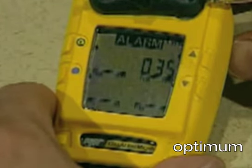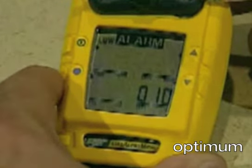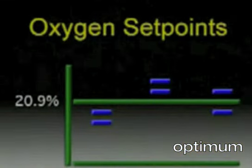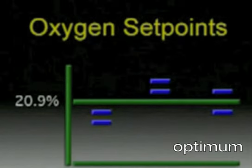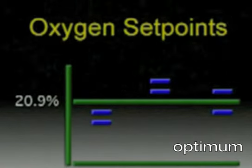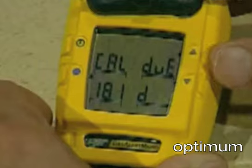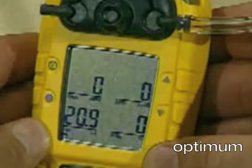Next, save or reset carbon monoxide values. Change or reset the displayed low and high alarm set points for combustibles or methane. Gas Alert Micro allows you to set both the low and high oxygen alarm set points below or above 20.9%, or one below and one above 20.9%. The detector will beep four times and then advise the calibration due date in days. Press the up and down arrows to change the days and press the OK button to confirm the new value. Gas Alert Micro will now beep five times and return to normal operation.